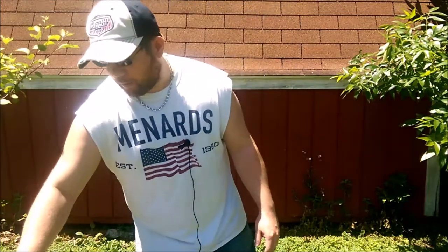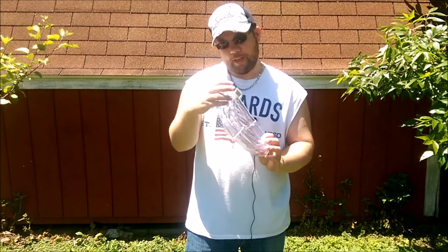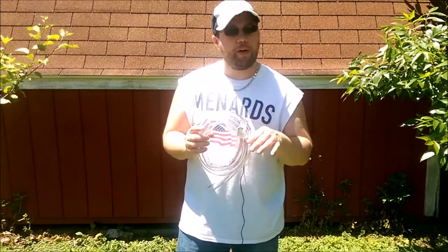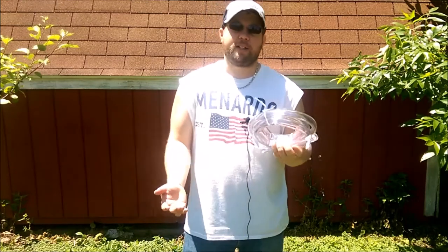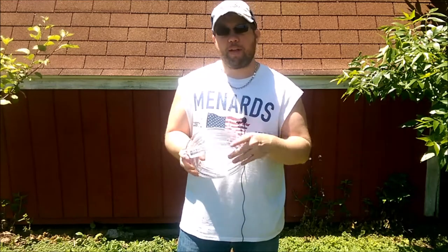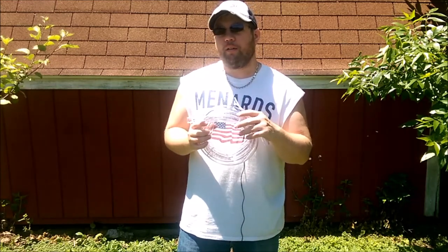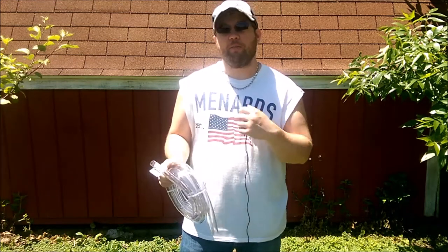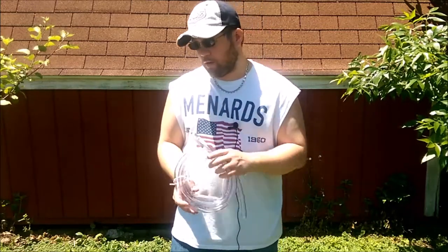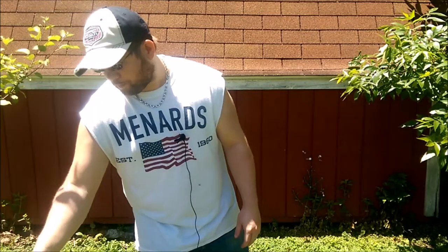We're gonna do that same connection to the top of the rain barrel, connecting it with this hose, and I forget what size it is. This has an inside diameter of 5/8, and it's a snug fit, but it's not really tight. I wanted that because obviously the end that is on the plastic barrel needs to be removable. I don't want something that I'm struggling and fighting with, so I don't know if it's going to need a hose clamp to hold it in place, but it'd be easier than struggling with a hose that was a more tight fit. So we're going to do that.